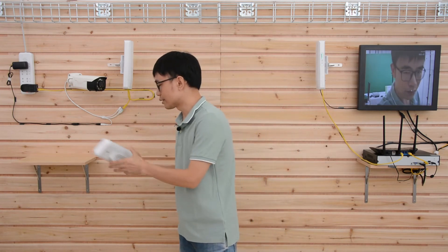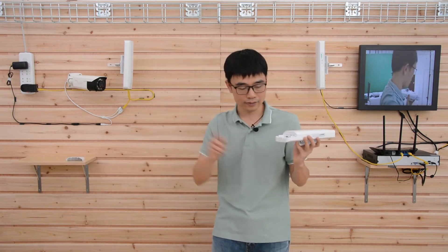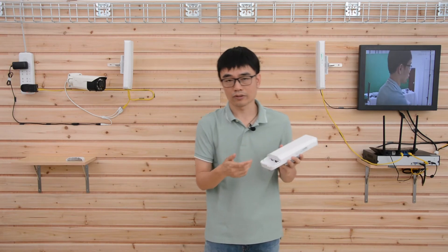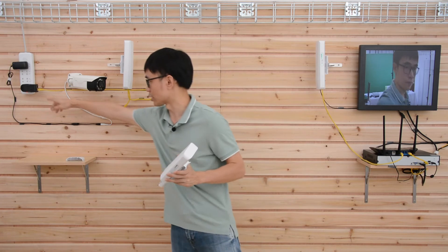Using this wireless bridge is quite simple. The first thing is to power up the bridge at both ends. You can either use a DC tail voltage or PoE. However, note that it is not standard PoE — you need to use a passive PoE injector like this one.